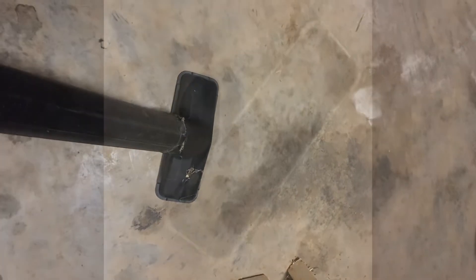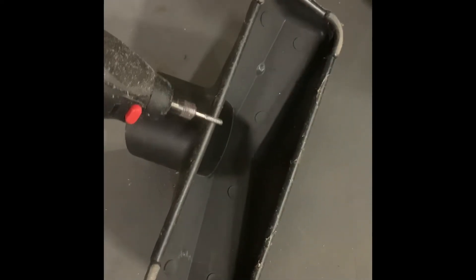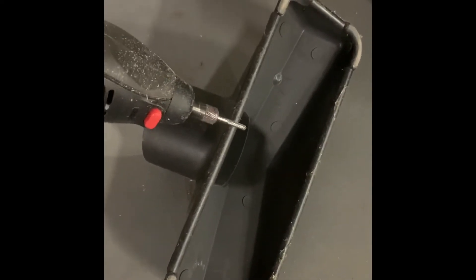Let me show you how to make that not happen. I've got the piece off, and what I'm going to do is use my Dremel and just cut a relief into the side here. Should be as simple as that. You can see right here I just cut a relief to let air go through, and that should be good enough to make it so it doesn't get stuck.